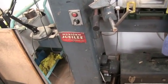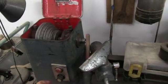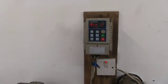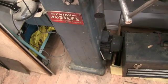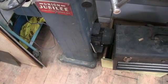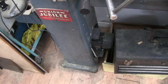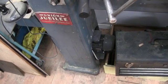I run my wood lathe sort of once a week or so, just to make sure it's all working. Unfortunately, when I run it now there's an error — there's something wrong. I don't think it's the inverter; I've got a feeling there's something with the motor. I could do without this, but I'm going to have to drag it out and see what's the matter — whether it's completely buggered or sounds like it might be the capacitor that's packed up. That's something I'm going to have to look into.